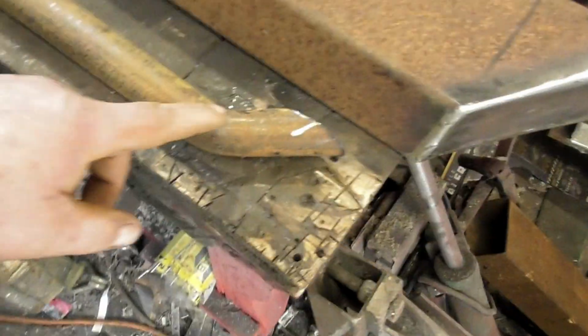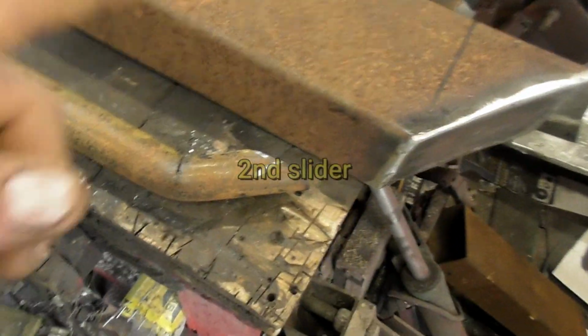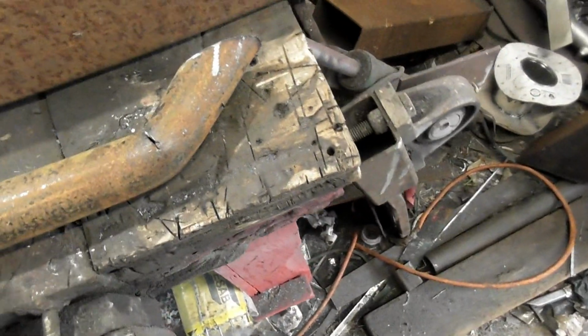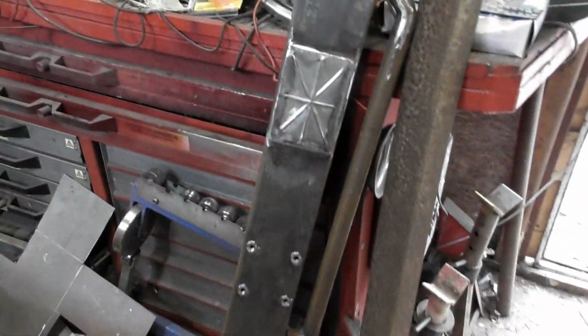I'm now on the bar, as you can see there, and all I've done is slotted and then trimmed. I've got to make two brackets up each side, bolts and a piece of 6mm rod going down. The reason the rod's there is to stop everything from pulling when I weld it, basically. So I weld them first, grind them flat, grind round there, and then I bolt the panels on, put the wire in, and then I weld them to each side. After I've done that, we've just got the Union Jack to do, and we've got to make another 3 more of those because I want 2 on each now. I've decided that that needs 1 more.